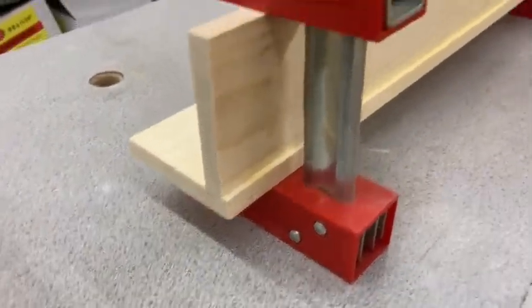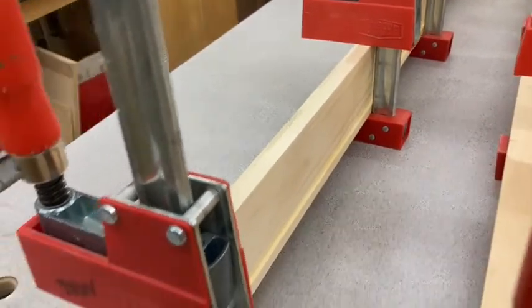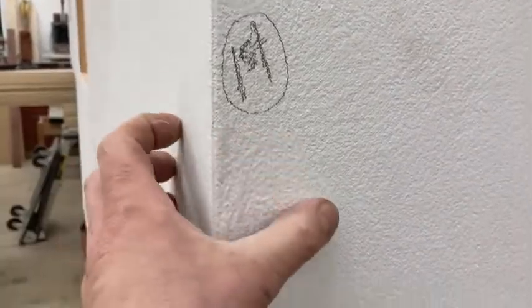But yeah, it's quite chilly in here, so I'm going to wait 10 minutes, maybe 15, and I can probably scoop a lot of that out with the chisel before it fully hardens. And the inside, as long as there's no big chunks, it should be fine. My corner has a slight radius, and by the time there's PL glue, it's gonna be sitting off a bit. So as long as there's no big hard pieces to really impede it, that should be fine.